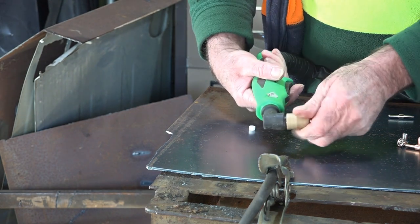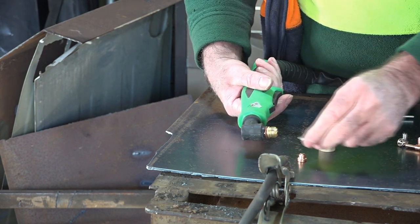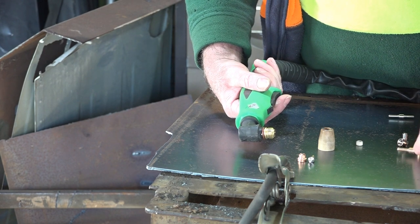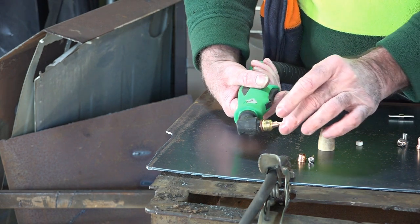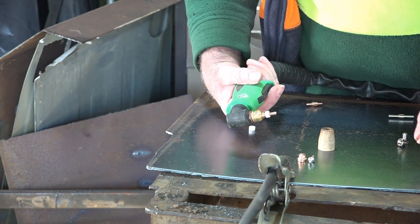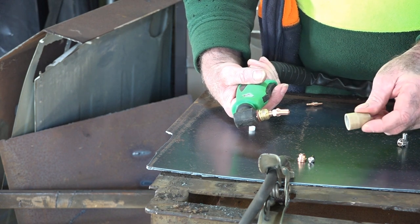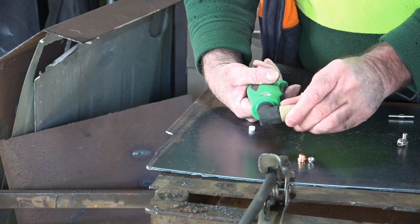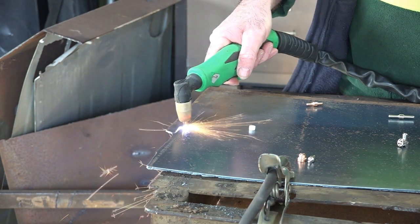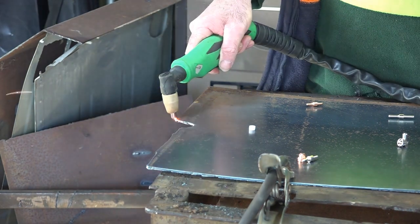Beautiful. Now we'll put some long ones in. So what have we learnt so far - you can mix copper with nickel, as long as they're both the same length. So now let's have a go with an extendable copper electrode, same swirl ring, and an extendable copper cutting tip. Exactly the same ceramic again. Now you notice we're sticking the long way up.